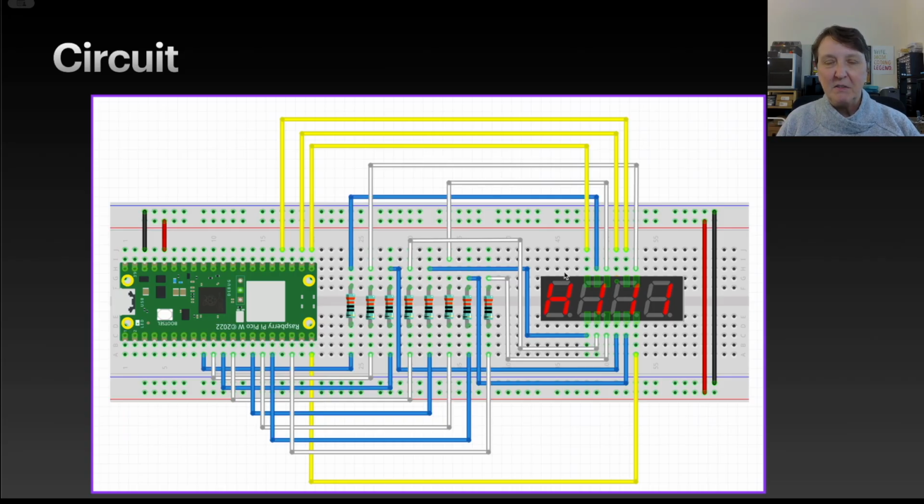Again, just as we had with the original single 7-segment display, you will see some people just put resistors on the digit control pins, and again, I think that's okay, but you do run into the issue that you're turning on multiple LEDs within a digit, and this one resistor is providing all the current limiting resistance for whatever ones you have on, and so a 1 versus an 8 will have a slightly different brightness that way. It may not protect the LEDs sufficiently enough when you have lots of them on.